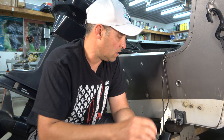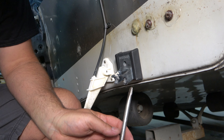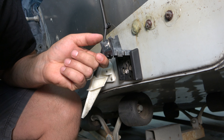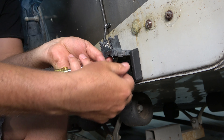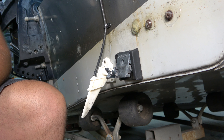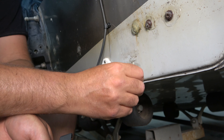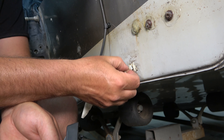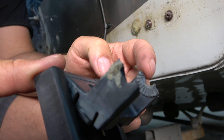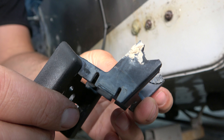First thing I'm going to do is remove the old transducer mount. On the old bracket you just pop open this, it lifts up and there are screws underneath. Looks like there are only two screws in there — pull them out and it comes right off. I'll clean this up a little bit; there's old caulk in there. Here's a closer look at the old one — you can see they just break right around where they make the circle to connect the other piece. Very weak point on these.